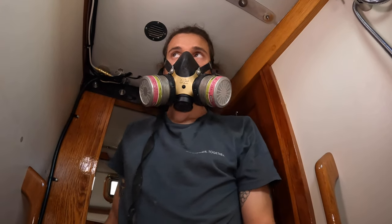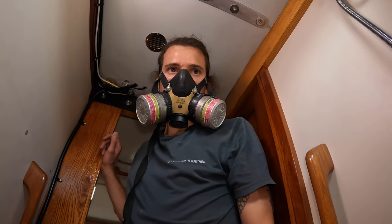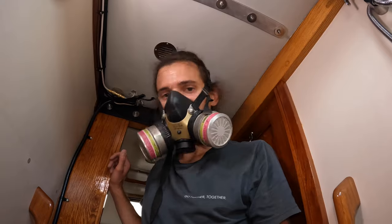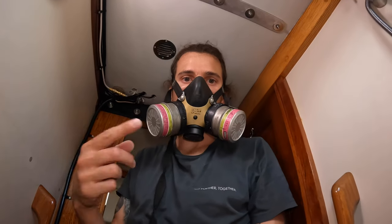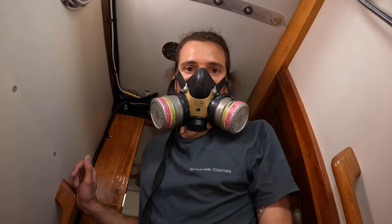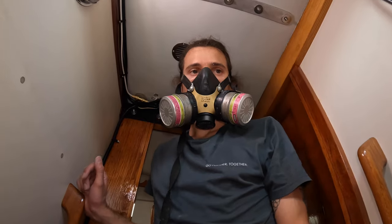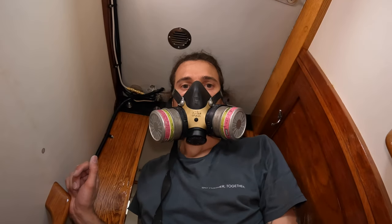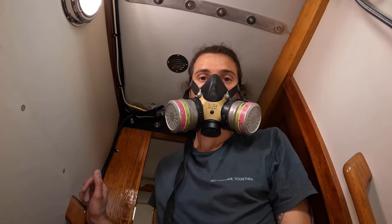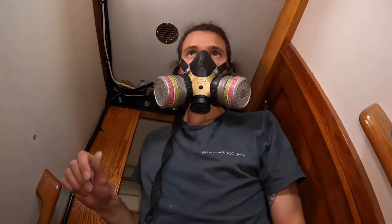It is hot today. Katy went to buy some groceries. So that's why I'm doing this. I'm glad it's done. I'm glad all this epoxy cured today. That's the benefit of working in the heat. If you don't have it go off on you, it's called exotherming. You can have the epoxy run away from itself and then it hardens really fast and maybe not in the shape that you want it. And then also it's weaker overall. So I'm very happy with how all of this stuff came out.